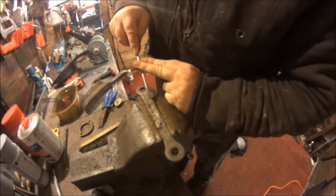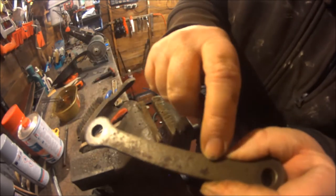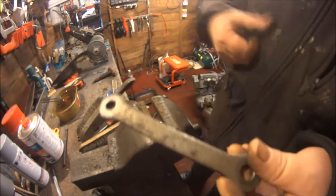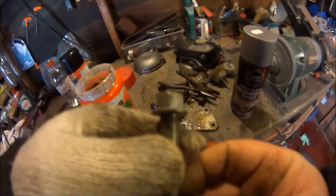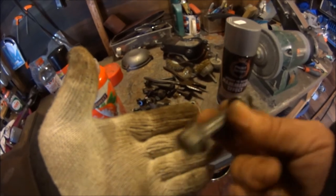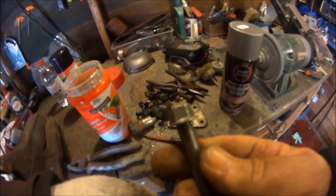It's looking good. See that, but you can see the craters where the rust has built up, but I don't think that's lost any integrity, do you? I'll leave that in the bath for a bit longer. I don't know if you can quite pick that up, but you know how rusty those bolts were? Well, this is one of them. What I'm thinking of doing is heating them up and dipping them in oil, making them black so they don't rust. That's what I'll do next.